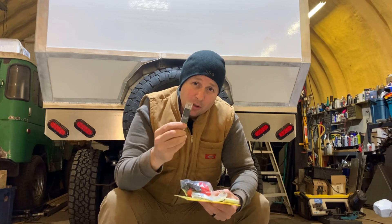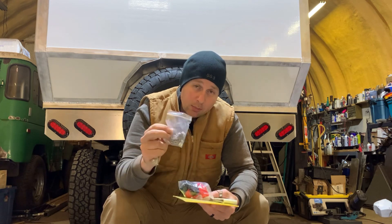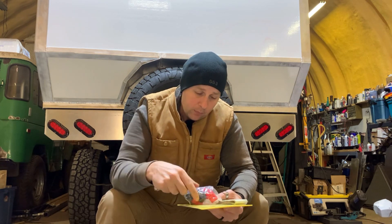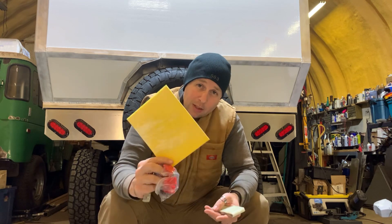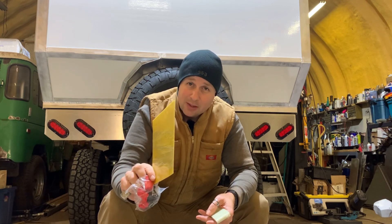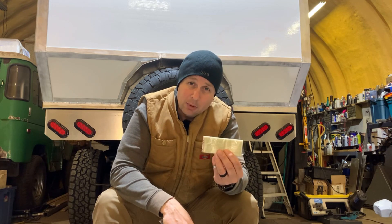These batteries also came with some nice nickel-plated and insulated bus bars, some stud and nut hardware, boots to protect the terminals, some dielectric shielding material to put between the cells when you build your battery packs, and some heavy-duty tape to keep them secure. Why do they need tape to keep them secure? Well, if they're not adequately restrained, lithium iron phosphate cells can swell.